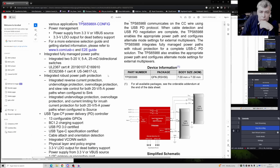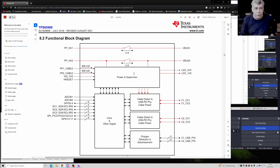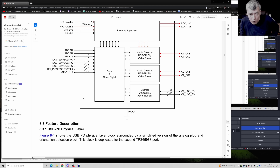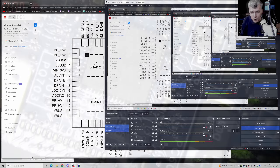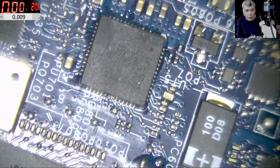I found it. So that's our chip — a dual USB-C PD controller. We have HV1, HV2, VBUS1, VBUS2, and we have LDO 3.3 and LDO 1V8 — exactly what I told you. So this chip is speaking using I2C, probably with the IO chip. LDO 3V3 is on pin 9 and we have LDO 1V8 on pin number 35. Checking pin 9: we have 3.2V. And the other one — 1.8V. So we do have LDO 1.8.